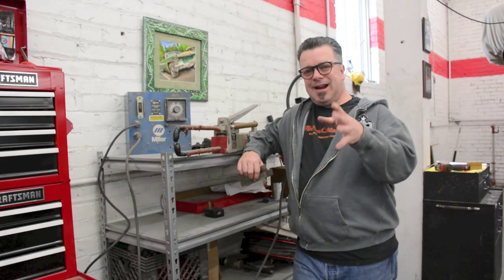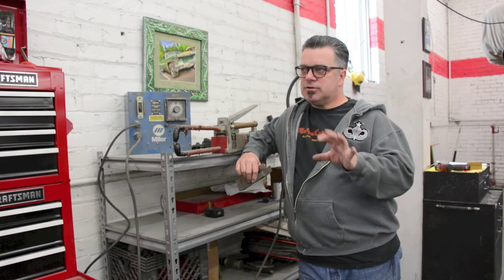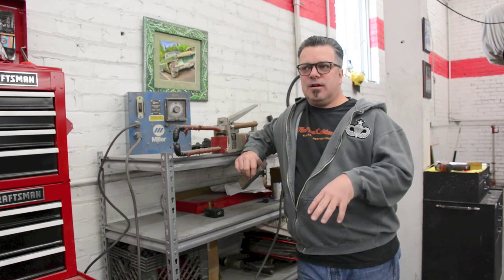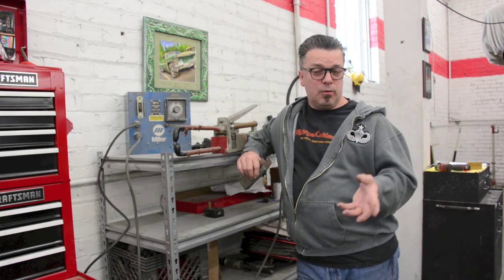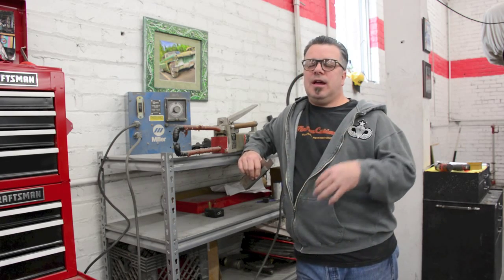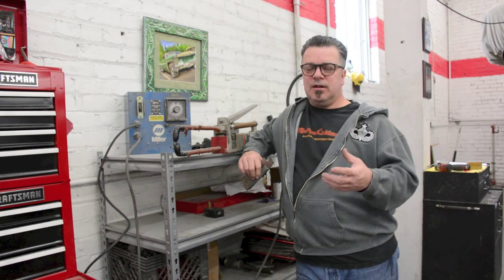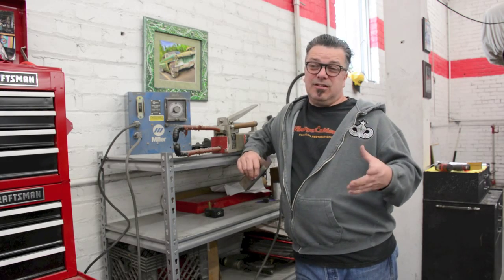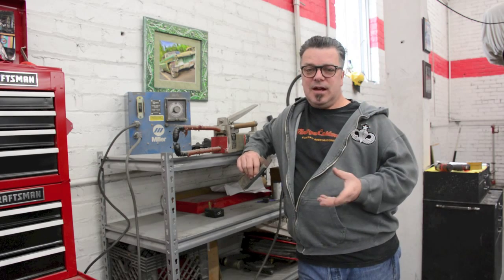So sometime in the late 80s, Mercedes-Benz, BMW, and Ford all started looking at a different way of constructing cars. Yes, they started to develop much better weld-through primers to minimize the quickness in which a car would rust, but they also started looking at other ways of construction. That's why nowadays a lot of cars are constructed with what's called bonding agents. They're not welds at all. It's literally just two chemicals, like an epoxy, if you will, that fuses panels together.